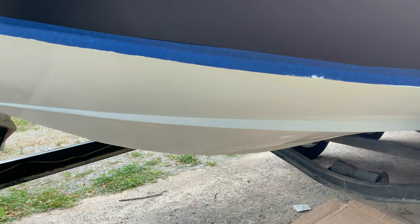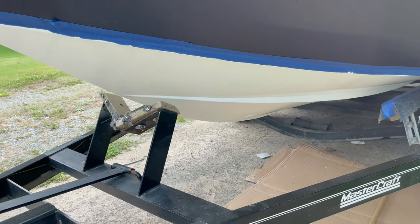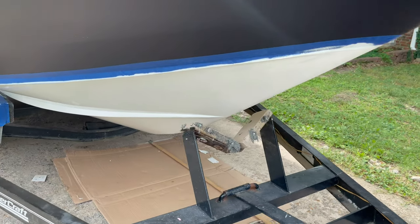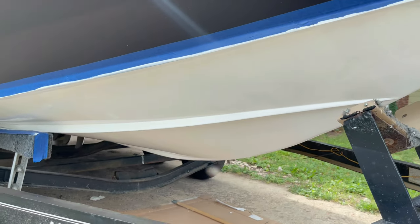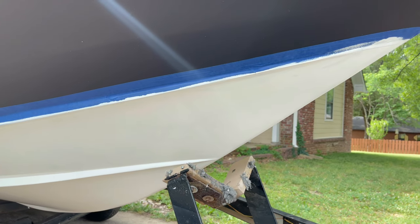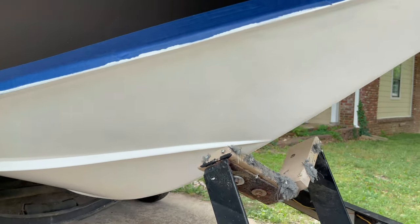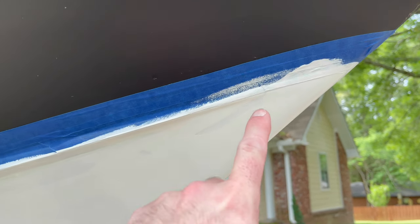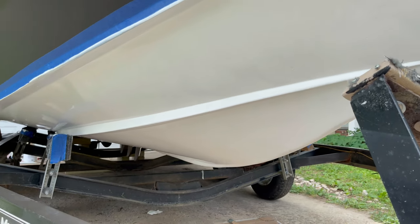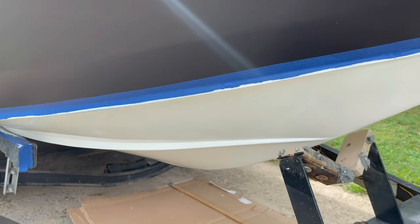That's the second coat. It's definitely covering a lot better and looks slicker now. I added just like 2 splashes of thinner to that whole gallon, just poured some out. So it was a little thicker, but it acted like it wanted to sag more today. But as you can see, I still got some of that gray showing through. So I'm hoping one more coat will get it looking pretty good. Fingers crossed. I don't want to have to do 2 more coats.